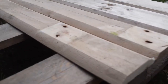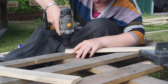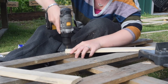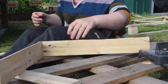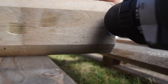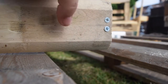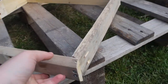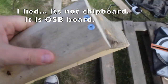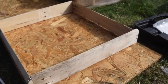I needed it light because if it's going to sit on my lap I don't want a big heavy box on me. So what I've done is cut four pieces of wood around 40–45 centimetres long, basically because I wanted it to be able to hold my A3 sketchbook landscape or portrait. I've put four pieces of wood together into a square and then I'm going to pop that on some chipboard and mark out the size so that it's got a chipboard base.